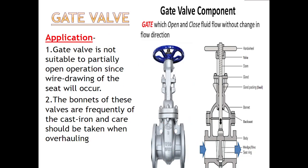The gate valve is suitable for operation normally to be kept in an open condition. It means the gate valve is used only to open or close the fluid flow — it is not used to throttle the fluid flow. For any operation which requires throttling, you will find maximum application of the globe valve. Therefore, most centrifugal pump valves are globe type. Basically, the gate valve is only used for opening and closing the flow.